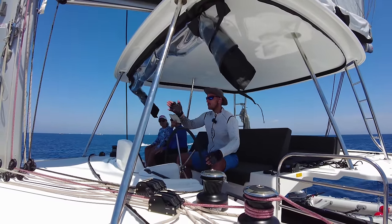Another beautiful bay where we anchored, so it's pretty calm. It's around 6 to 7 meters deep, and I dropped 18 meters of chain. Now, I didn't really go reverse with the boat to dig it in, as there's not much wind. So I dropped it, went slightly back, laying the chain nicely on the ground, and then just stopped the engines. I didn't go reverse to dig it in. So let's see now what happened.